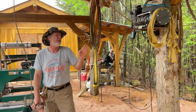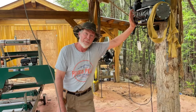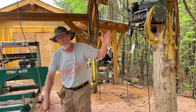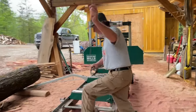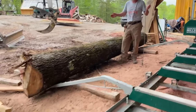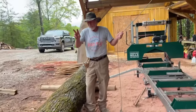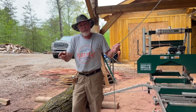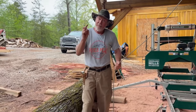If you have a small 2,000-pound winch, you're only going to be able to roll about a 500-pound log. A lot of guys have these on their trucks — I showed you how to make it universal for your truck and your mill. Now, I know I promised you an oak log, but what we put out here is a giant hickory. Hickory has a higher log weight than oak, so it's going to prove my point about rolling, and that's point number two.